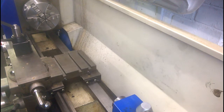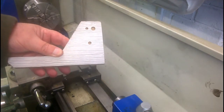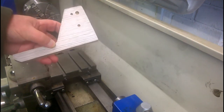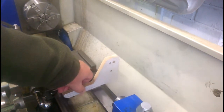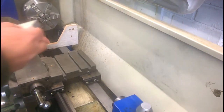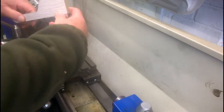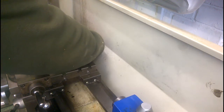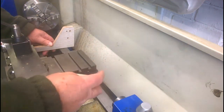Here we are then over at the lathe, and basically what I'm going to do is mount two supports like this, virtually identical, on the lathe bed such that they fit across the lathe bed like that, one at either side of the cross slide. Each is braced to the back of the bed by a brace like that, which is attached there, and that holds it in place. Similarly, another one up here in between these two supports